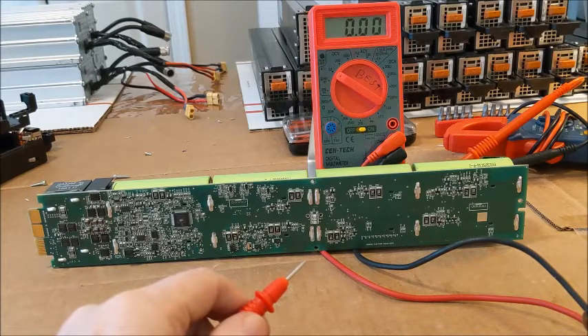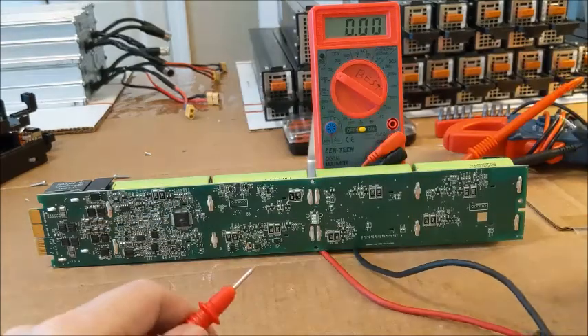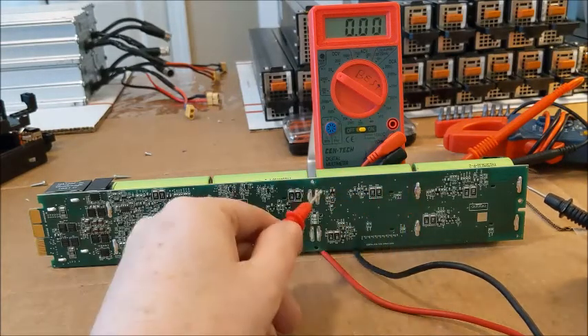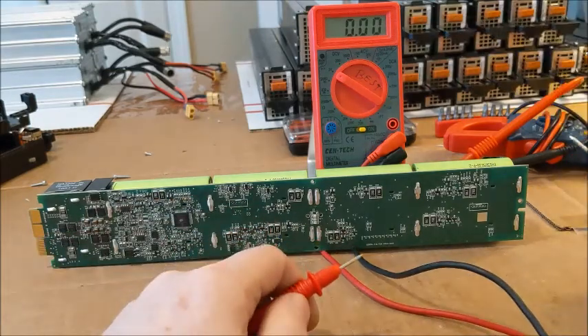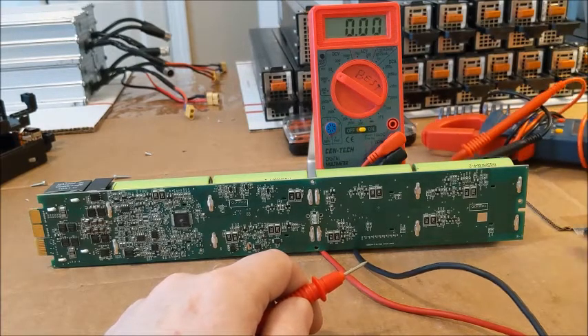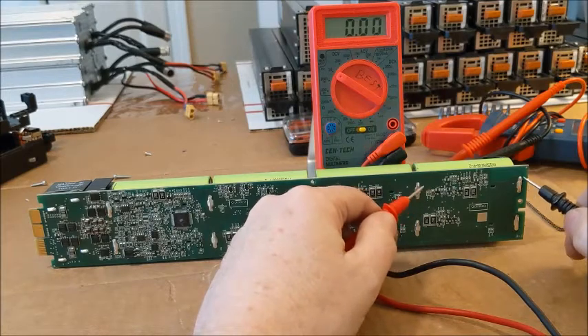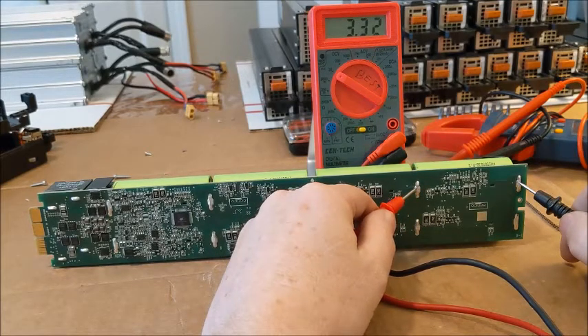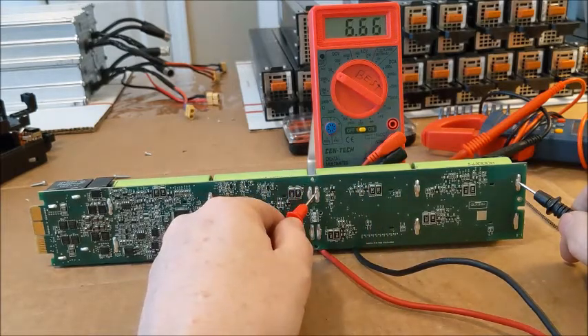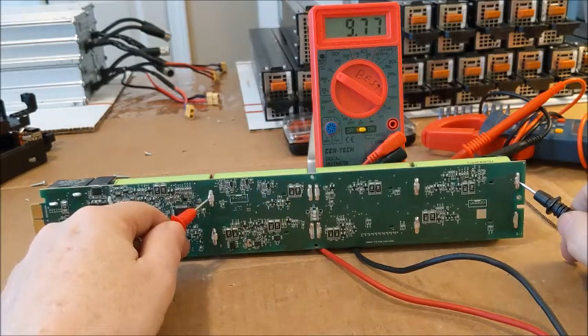Now I've got everything set up so maybe you can see this a little bit better. Sorry about that — I'm not used to filming, and I didn't see anything on YouTube so I wanted to get this out there. You can see on the BMS board your different attachment points, and we can check the voltages there. One set of batteries in parallel, two sets, three sets, four sets, etc. You can see my meter up here — it's a Harbor Freight, but it sits on my stand nicely and it's pretty accurate. Let's check the first battery connection: 3.32. Jump up to the next one: 6.66. And the next one: 9.99.